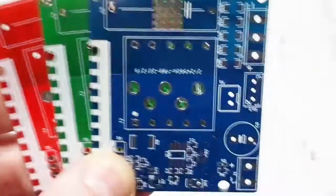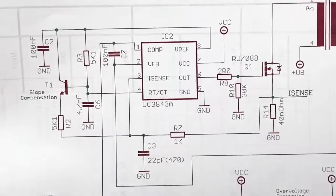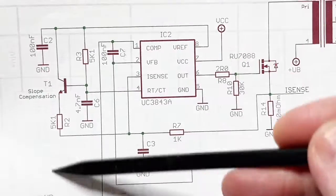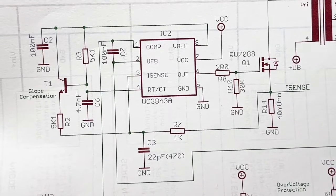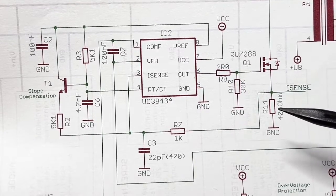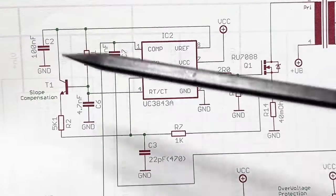If you're working with high voltages, you should test the capacitor at its rated voltage and not at 5 volts. Anyway, let's go to the schematic. The controller chip design is a schoolbook, application note design. The UC3843 version goes up to 90% duty cycle, and because it is over 50% and current mode, sub-harmonic oscillation can occur. This is why they use slope compensation to dampen it.